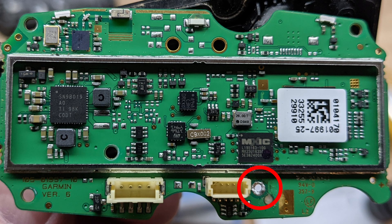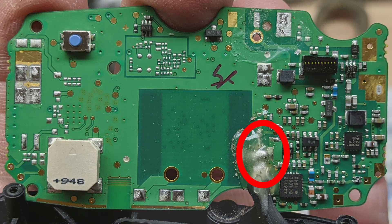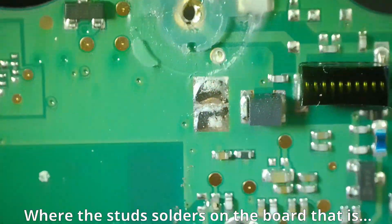Here's a picture of it after it's been cleaned up. Here's a picture of the back side of the board where we need to work on the antenna. You can see this glob of silicone we have to work with. Also notice that these models have a spot on the board — they had provisions for putting a jack there but didn't, at least on this model. So we have to desolder and then solder back on this antenna that sometimes gets cut or damaged.